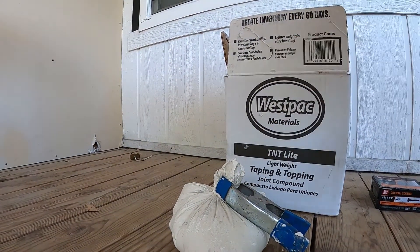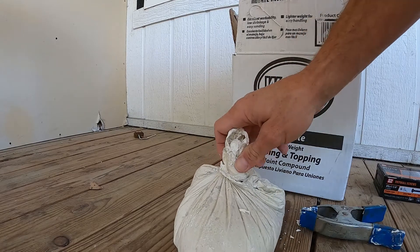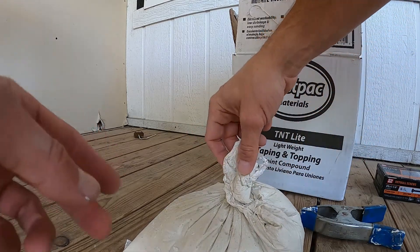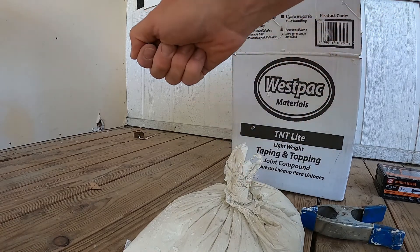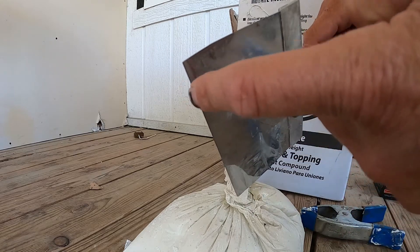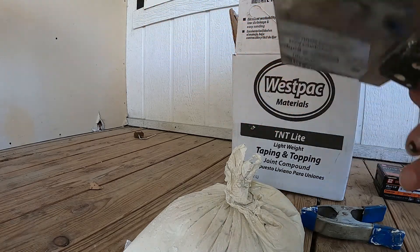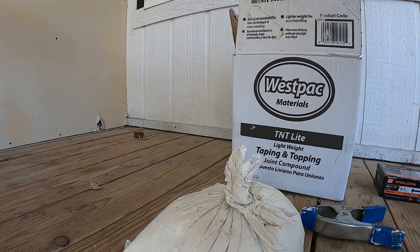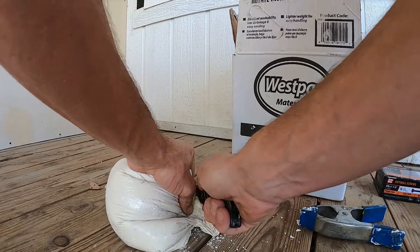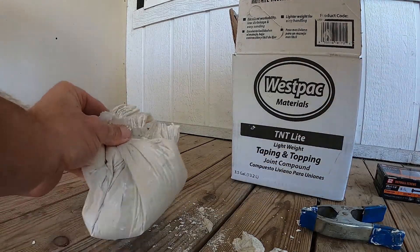When re-opening these bags of mud, you need to make a little cut at the top because when you twist them up to keep the mud from drying out, the upper half of that twist does dry out. If you were to just open it up, all that crumbly dried drywall mud falls into your mix, and when you go to spread it, those rough little pieces are like rocks — they'll pinch at the edge of your joint knife or taping knife and make grooves in the wall, so you won't get a flat, even spread. To fix that, just cut the twist off to get rid of that dry stuff.